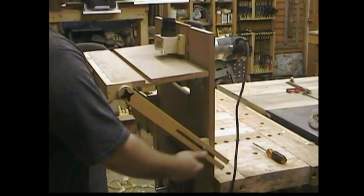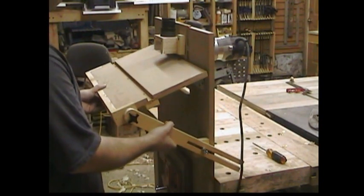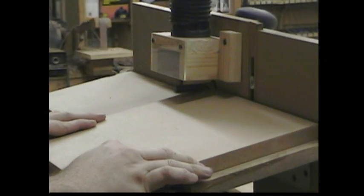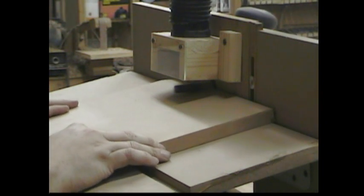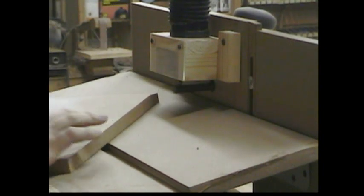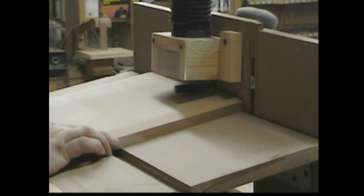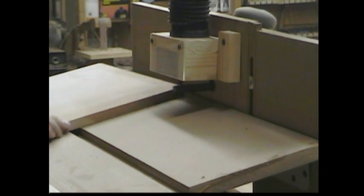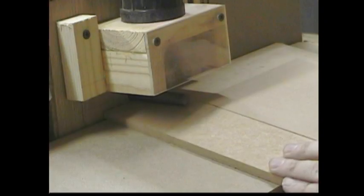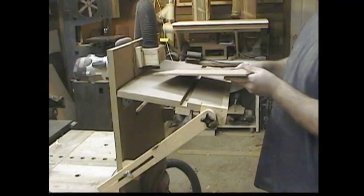The basic shape I saw on the internet once, but I remembered enough to make this, adding a lot of my own design features. All you need to build it is some scraps of plywood or MDF, a router which you probably already have, and the longest straight router bit you can get. I designed it so you could use fancy profile special raised panel bits if you've got money to spend, but you can also just use a straight router bit for simple raised panels on the cheap. I found it to be more accurate and even safer than doing it on the table saw with a special jig and having to change the bevel angle of the blade.